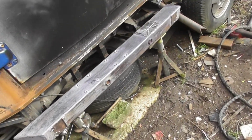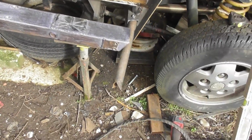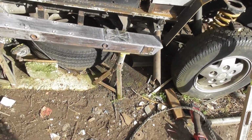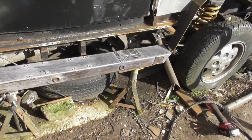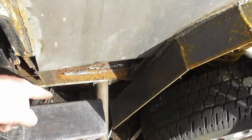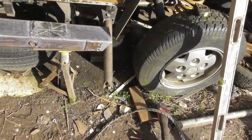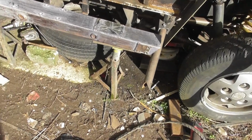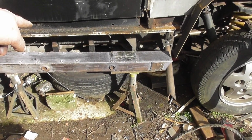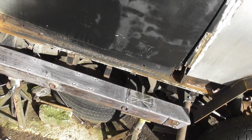Okay, so what I've done instead, completely the opposite of what I spoke about, is I've bolted two pieces of really thick heavy tube in the actual cross members themselves. That way I've managed to keep the original bolt holes and the little props. I've got to make the same props on the other side as well. What I've got to do now is trim up. So I've got to cut along that line, and then drop the piece of metal in and under, and then I can weld up behind each side. I can add more support if needed to where those old gas tank straps are that are welded on. We can come off of that and go straight across if we really do feel the need.